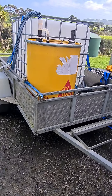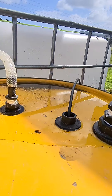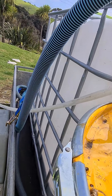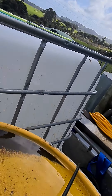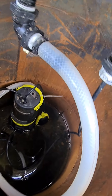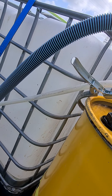I've just made this trailer for a vacuum recovery system. Basically how that works — vacuum comes in here, which causes suction. That's a vacuum line — I've got about 27 meters of vacuum hose. There's a line down to a submersible pump. How it works is all the solids stay in the bottom, and it pumps out down the grass or into a tank, whichever way I want to do it. So if I need to take it away, I can.